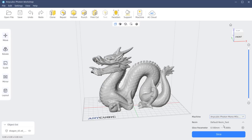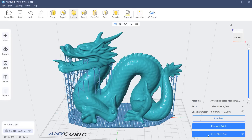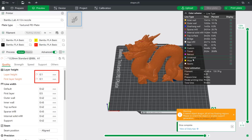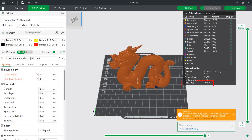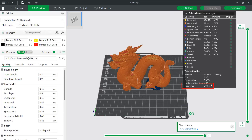Let's slice a dragon model. When using an FDM machine to print, the support inside the mouth is difficult to remove and it takes a long time. I'll add minimal support and use the fast 0.1 mm layer height with 3.8 second exposure profile. The estimated time is 2 hours and 27 minutes. When printing the same model at 0.1 mm on an FDM printer, it takes 9 hours and 48 minutes. Even at 0.2 mm layer height it still takes 5 hours and 45 minutes.